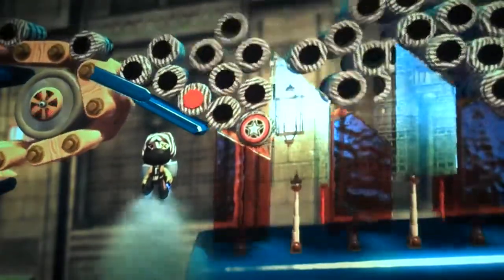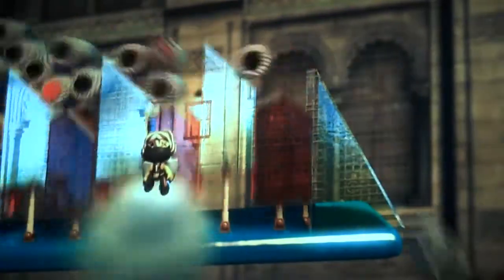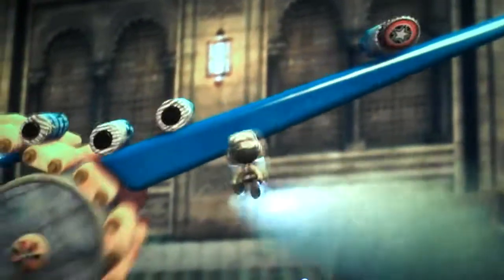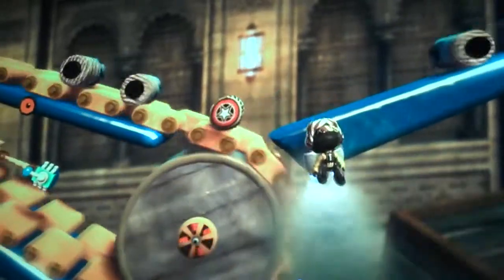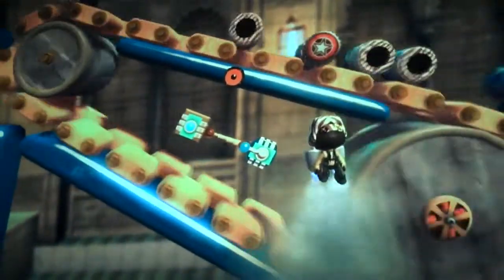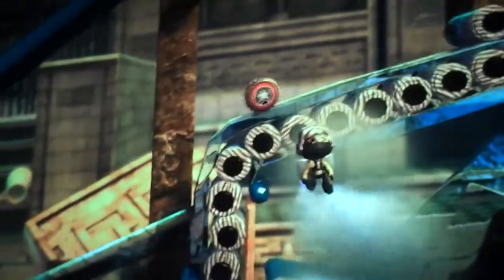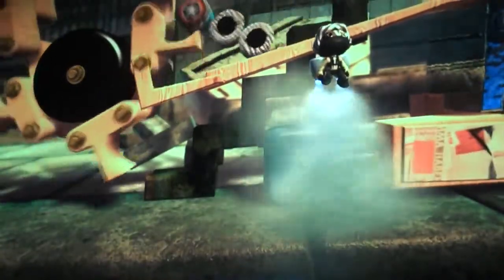This part might take a while. Okay, then it falls down to here onto another conveyor, which will take it into the sorter. The sorter basically gives them three options to go to based on what's full and what isn't full. If it's too full, it rolls over the top and lands back down here, and it's at the main conveyor again.